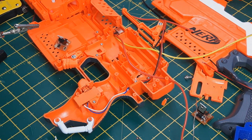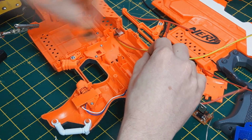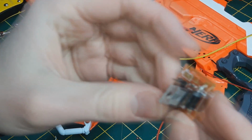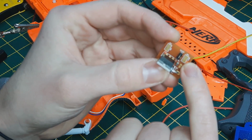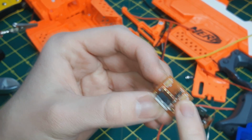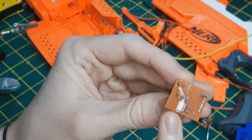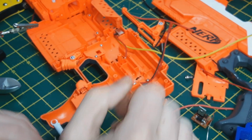So the next component to solder is the positive, this red wire here. Now I'm not sure you'll be able to see this on the camera, but on each of the solder pads it has the colour of the wire that you should be expecting to join to that solder pad. So VBAT here is red, black is ground, and then on the other side here you have blue or yellow, depending on your high power or regular, the motor negative terminal.